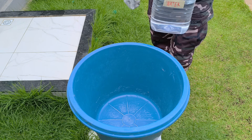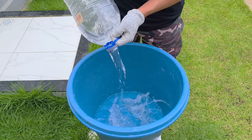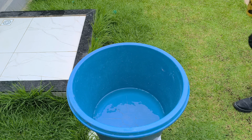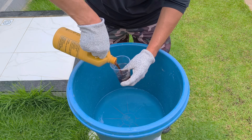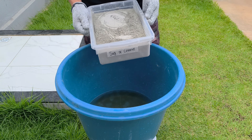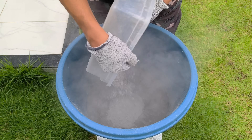It's time to prepare the first stage of this experiment. I'll start by pouring three liters of water into a clean basin. While still using the water, I add 50 milliliters of common plasticizing additive. Next, five kilograms of cement are added. The function of the additive is to improve workability, making the mixture more malleable, homogeneous, and easy to control.